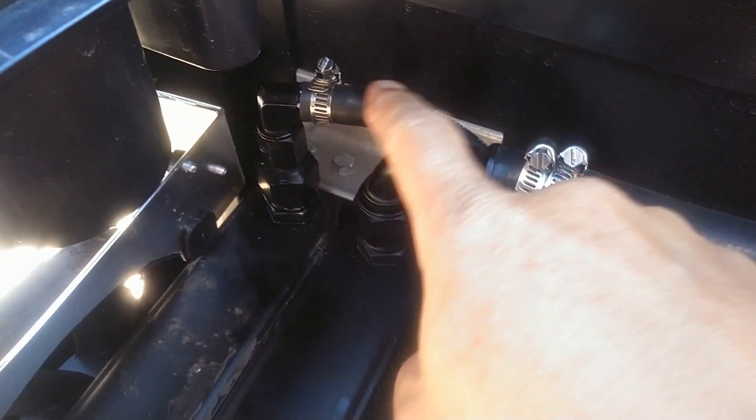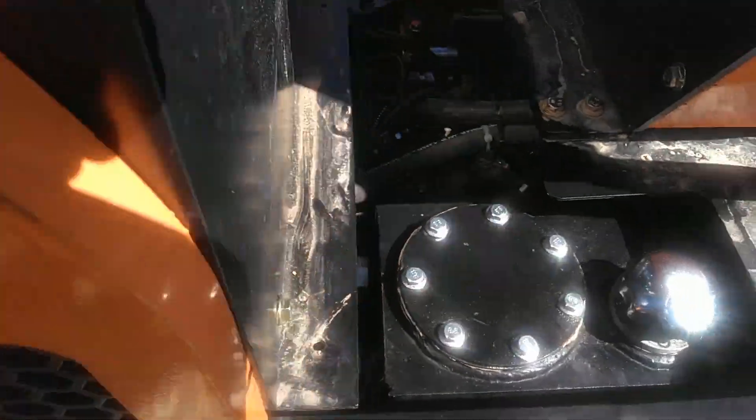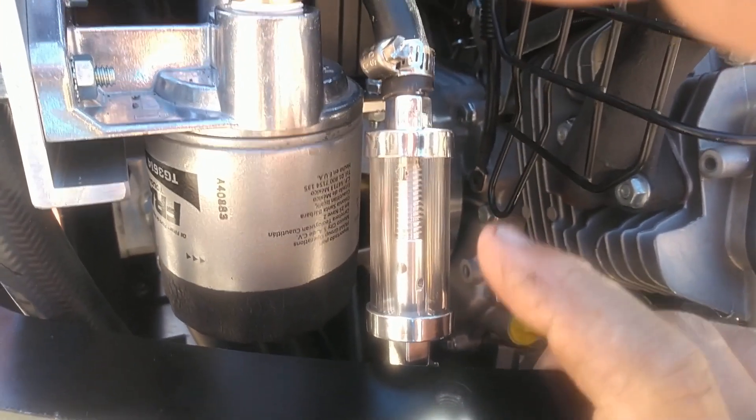On the other side of the radiator the hose goes down to the check valve, then into the front side of the engine. It was an extremely tight fit in there — I had a really difficult time tightening fittings and removing the plug because there's very little space to work. Next time I'd unbolt the engine from the mount and move it over to get more access. The next step is to fire up the engine, watch the sight glass, and see if the pneumatic oil pump actually works.